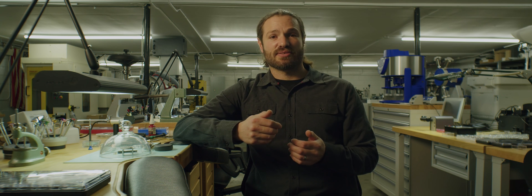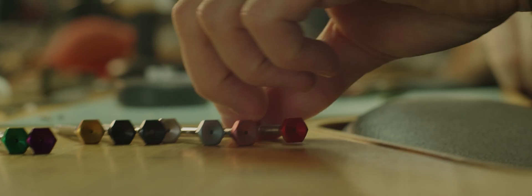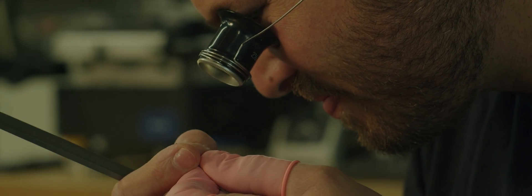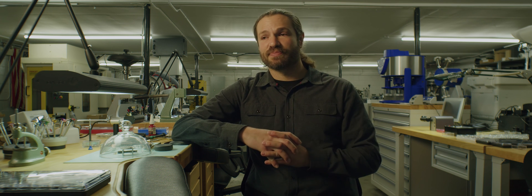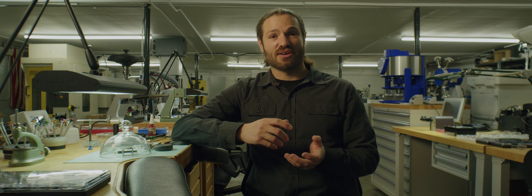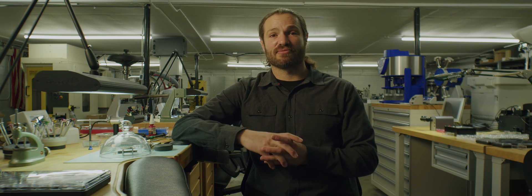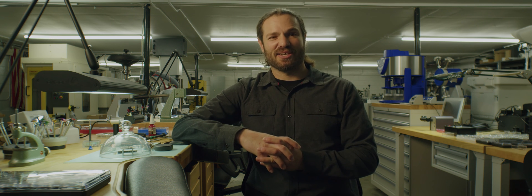The reason we have to think about this is because you have two eyes in order to focus and understand depth, and being able to understand the depth of your movements and where parts are within the watch is very important. When working with a loupe, you'll have both eyes open — it's best not to squint one eye and close it. This allows you to change focus and train yourself to focus on what's through the loupe, and then if you need to look for a tool on your bench, your brain switches to looking through the other eye. This way you don't have to take the loupe on and off, and it doesn't strain your other eye by keeping it closed.